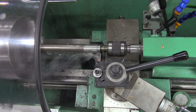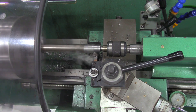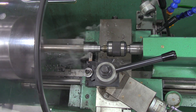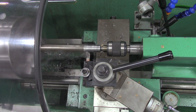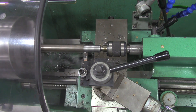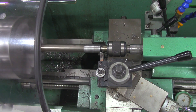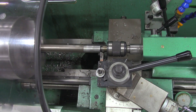An interesting thing: when you go in with this cutter — let's say you push it in .050 inches — that's actually going to take off .100 inches on the diameter, because we're cutting on both sides. You can also tell by the color of the chips how things are going. If you start to see chips turning purple, that means you're taking pretty heavy cuts and the material is getting very hot. In this case the chips are looking pretty good — mostly still that bright, shiny steel color. I don't think we're close to the .750 final yet.